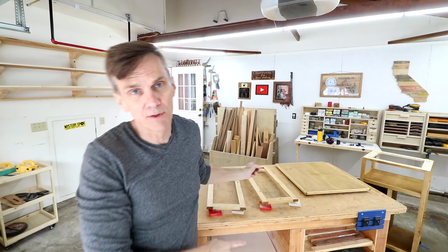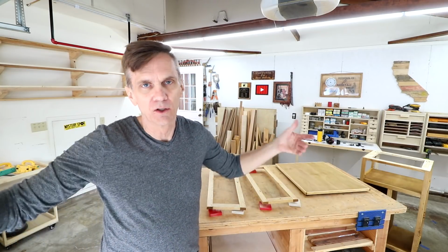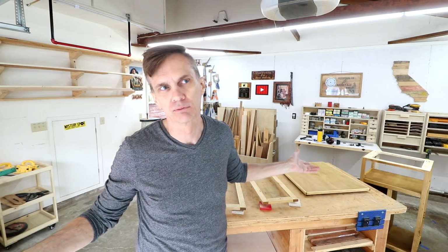Well, I'm not going to get to that third coat of polyurethane today because the weather is changing pretty drastically. I have a feeling it's going to rain either later on tonight or probably tomorrow. And with that high humidity and the cooler temperatures, I can tell it's just taking longer for that to dry. That second coat was still a little bit tacky when I was sanding it down, and that was after 3 hours or so. So usually it's dry by then.